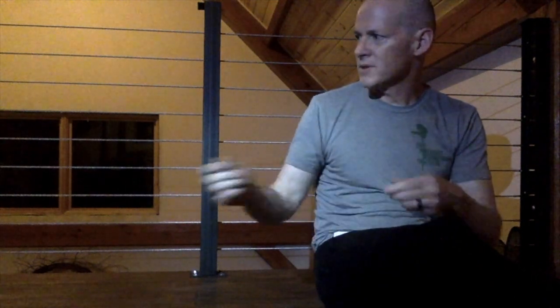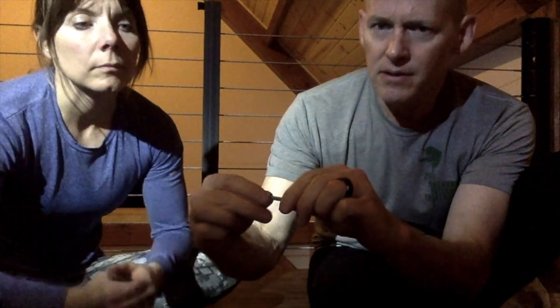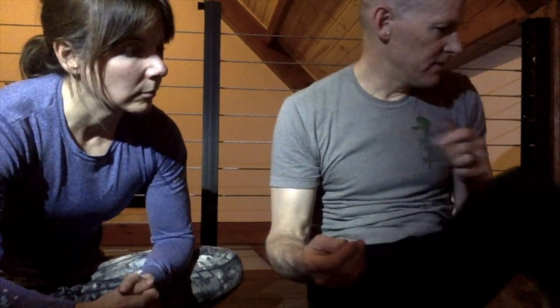So on the other end, we didn't have a turnbuckle. We just had an aluminum stopper, and so you can see here. It actually has a nice little bevel on one end of it, so that you could feed it in there pretty well, like that. And then the other side is a really tight fit. I mean, that's like thousandths of a tolerance there. And then I just used the bolt cutter on it, just like that, to squash it down. And so, again, that saved buying the crimping tool. But it worked like a charm. And these were $5 for 50 of them, or $10 for 50. It worked out super well.